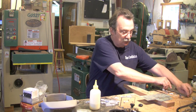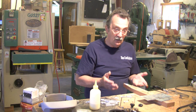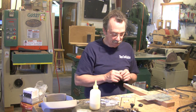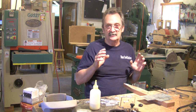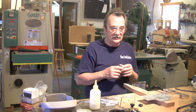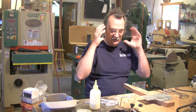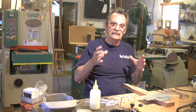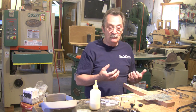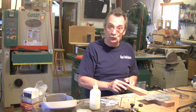So there's the cutting tool. Here is a pattern that I've already prepped. How do you prep a pattern? Well, first you've got to decide what you want to do. You aren't going to try to inlay the tree of life the first time you do this — I recommend working with something simple: geometric shapes, squares, oblongs, ovals. Your mind can work very well with simple geometric shapes. From there you can start doing more complicated shapes. This is a very simple shape — it's just part of a fleur-de-lis.